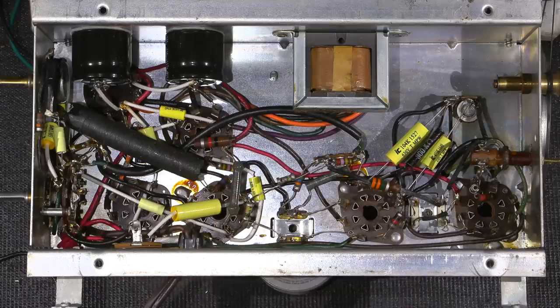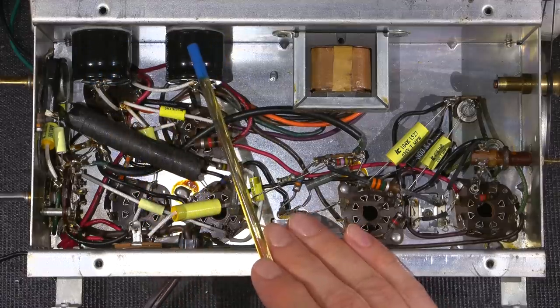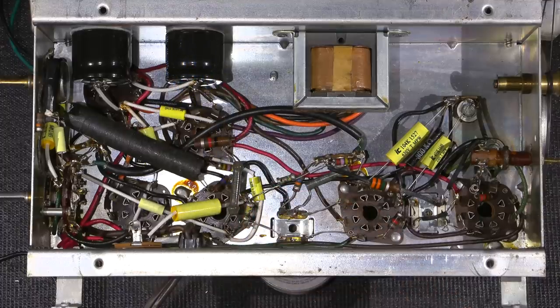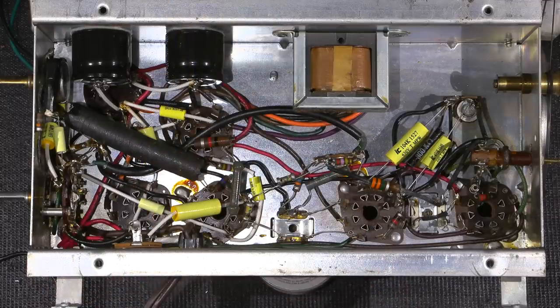And I'm going to talk about that when we take a look at the schematic here. So these are 400 volt rated capacitors. These are really overrated, but I like to do that. And these are very high hour capacitors. So these will last an extremely long time at 105 degrees C. These are designed for modern switch mode applications.